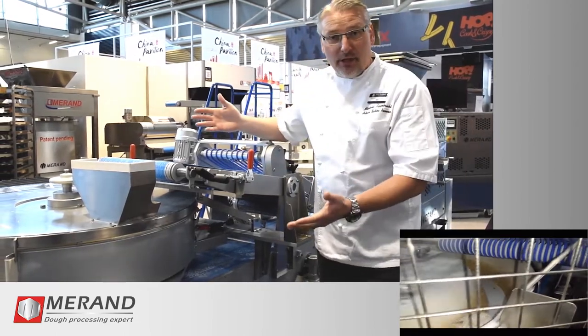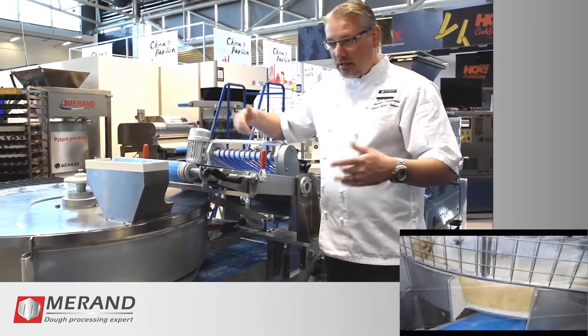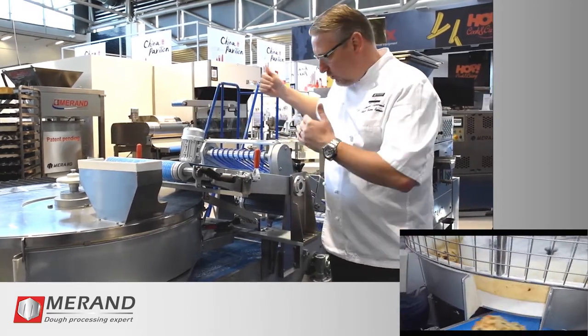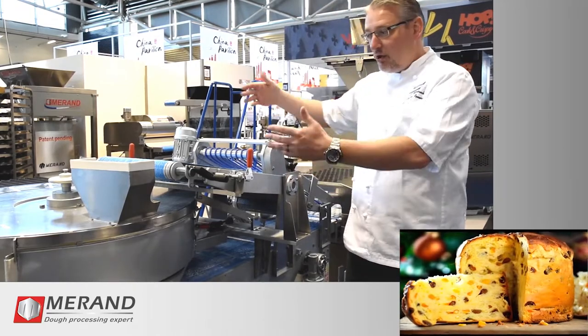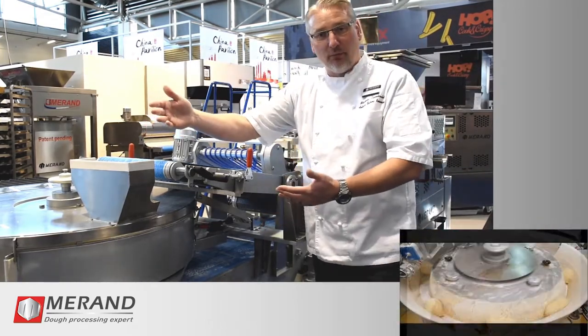We don't have an intermediate proofer on this line today, but that's an option as well. We have some bakeries that would like to divide stress-free, go into our eccentric rounder, and then go into an intermediate proofer.